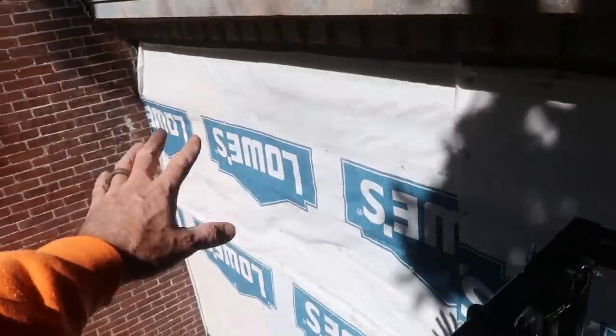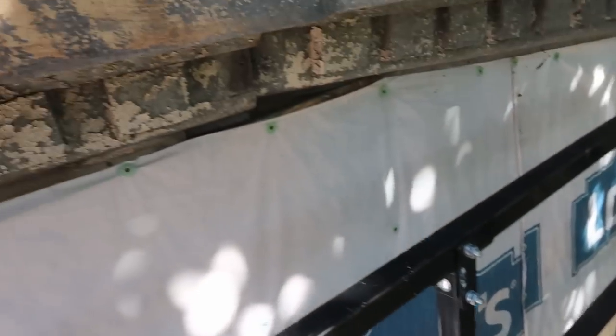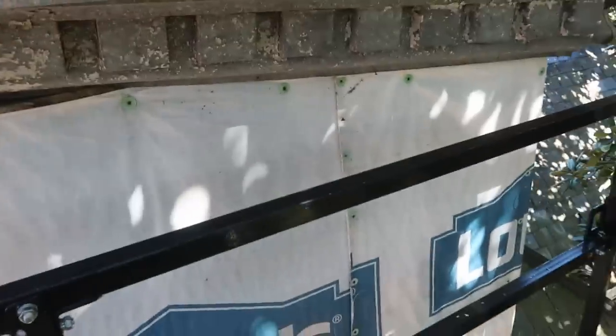This is what we're up against — this is the maid's room, and this wall right here is the temporary wall we put up since there was nothing there. We tried to figure out how to make it weatherproof, but this box gutter has tons of holes in it all along here and it just pours in. So we're just going to take the cornice molding off and figure out what to do.